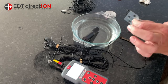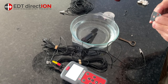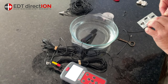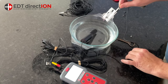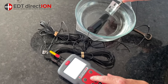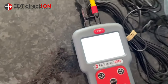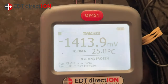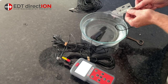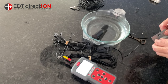So if you add a magnesium anode to our aluminium boat, what you should see is an increased negative result for the aluminium boat hull. And as you can see, that minus 900 millivolts has now gone to minus 1400. It hasn't gone to the potential of pure magnesium because you've got an aluminium component there.